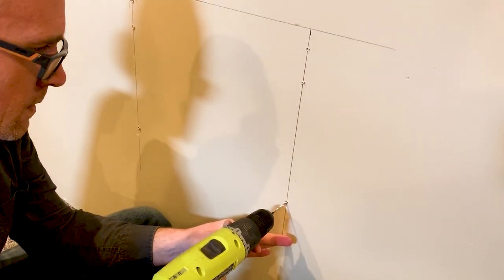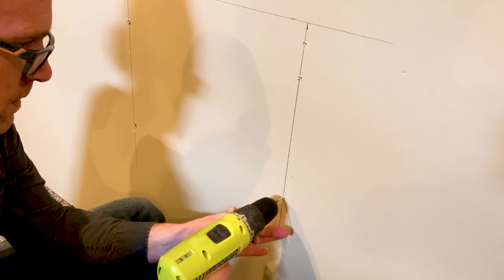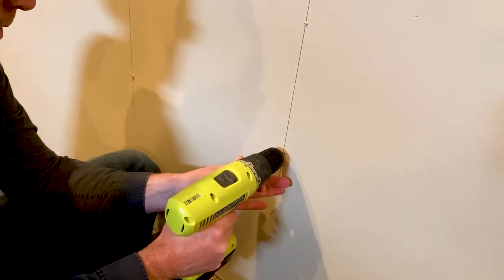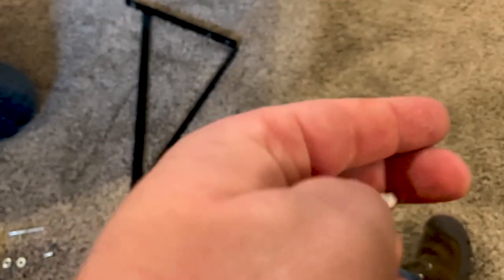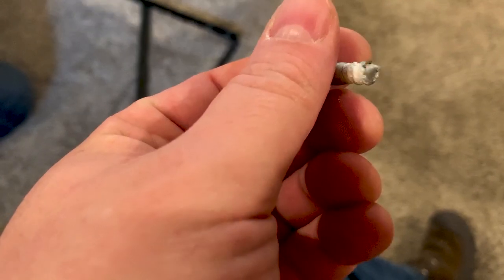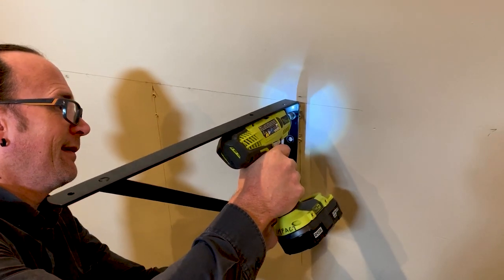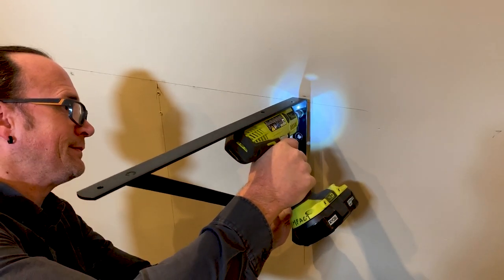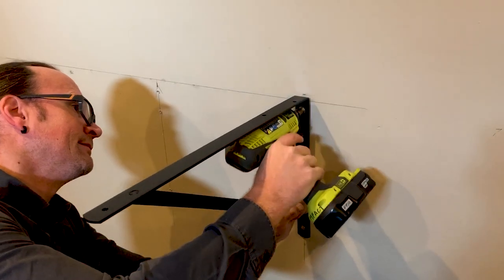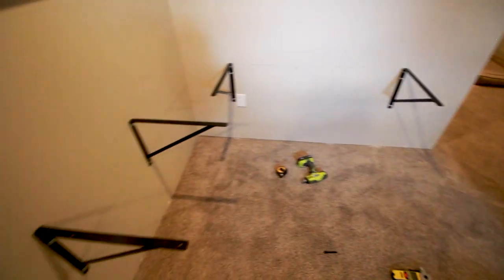But drill all three holes, then attach the bracket with an impact driver, and we broke lag bolts in the process. So what you want to do is, well, we adjusted all of our holes up a half an inch because we had already drilled before we started breaking bolts, and we ended up breaking more than one. So you get them so that they're still a little bit loose, and then you tighten them down with a ratchet wrench manually, and then you won't break any.